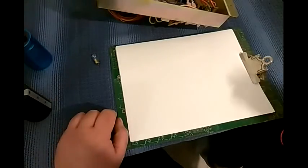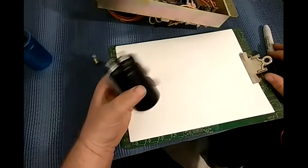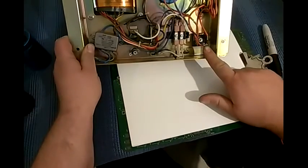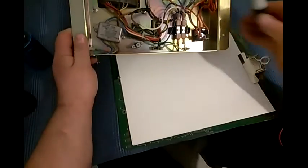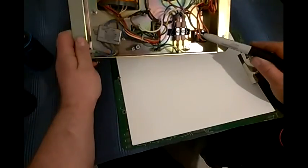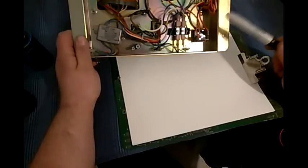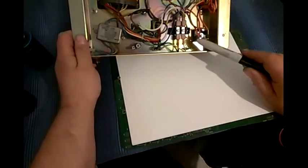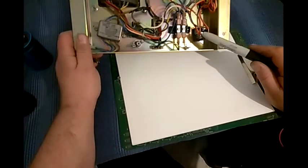This video is not over yet. If we're going to talk about BigBlue, then we're going to talk about your bridge rectifier, which is this guy right here. Whenever you have this open, you should test this, because your game can still work when this is bad. You can have random resets and all kinds of noise if this goes bad, or it may not work at all — but sometimes it does work.